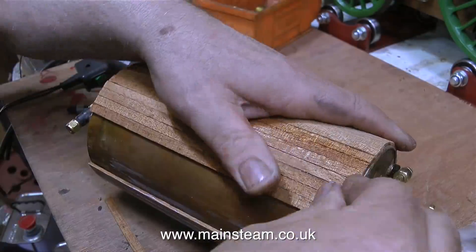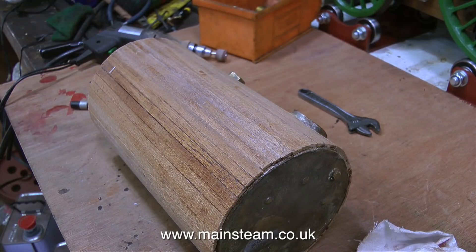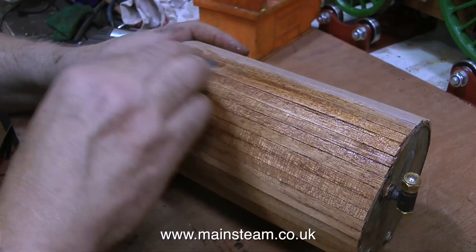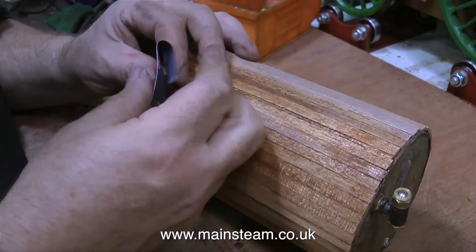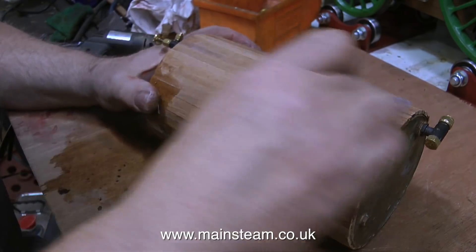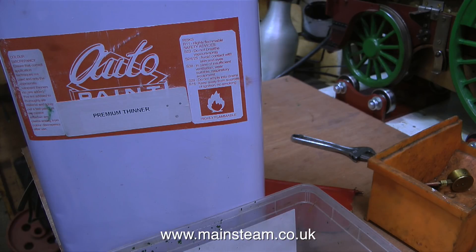Do be careful when doing this, because sometimes if you put four planks on and push them together, they suddenly jump over each other, fall onto the bench and fall onto your trousers or your t-shirt. Health and safety warnings, and these are important ones really: cyanoacrylate adhesive gives off very, very strong fumes, so always do jobs like this in a very well ventilated area. Also, it's a good idea to wear eye protection - in fact it's essential. I can't think of anything worse than getting some cyanoacrylate adhesive in my eye. Apart from a javelin - that wouldn't be too good either.